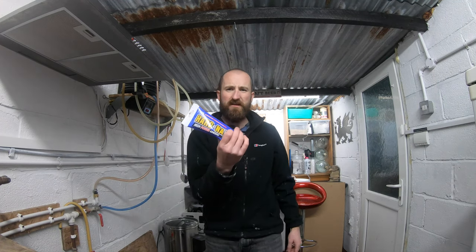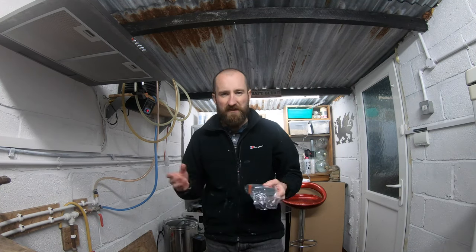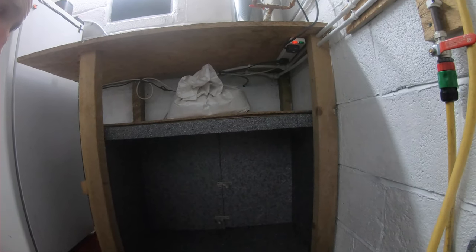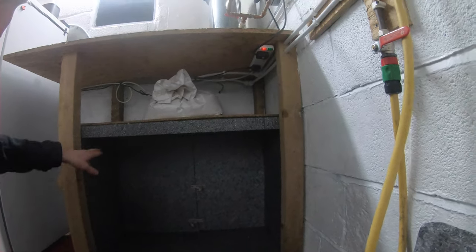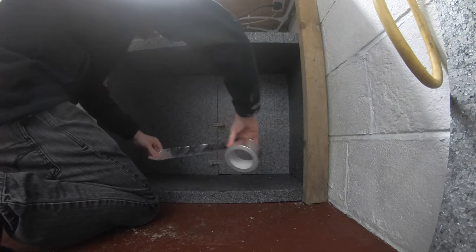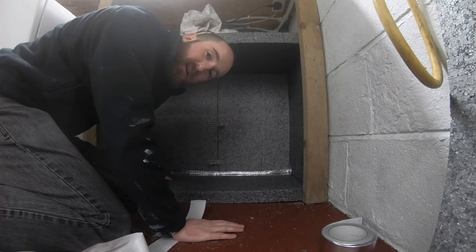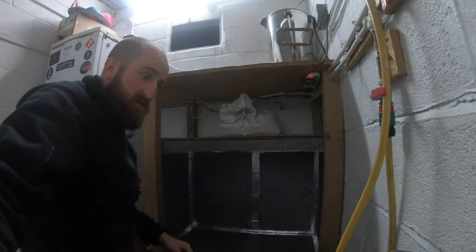That's the brackets on for the heater, and I've used hard-as-nails adhesive to put the lid on. I'm going to have a side access door, and that's where I'm going to put the STC, I think — not quite sure yet, just making it up as I go along. Whilst the glue is settling, I'm going to go all the way around the seams with aluminium tape — the kind that seals joints of heating and ventilation ducts. I've managed to cover all the internal bits with that silver tape. It looks pretty good, actually — I'm just growing beer!